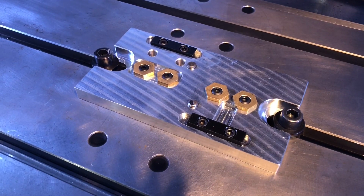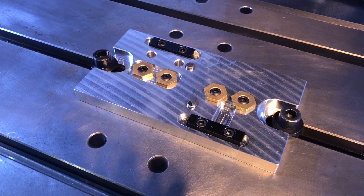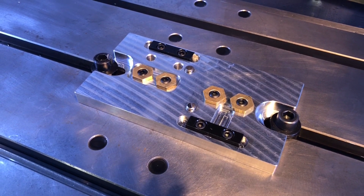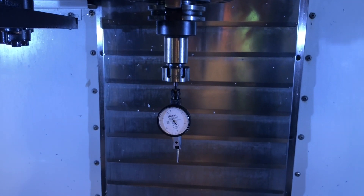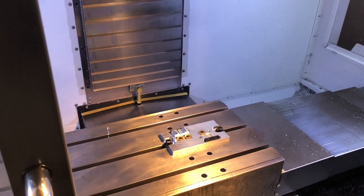The flatness of the plate was the primary datum. I used a rail for each operation as a secondary datum, and I used pins as tertiary datums. DFM was a huge factor in my fixture design, so I made it very simple so that it would be simple to make and very hard to screw up. To test my design, I first checked if the fixture would hold the stock correctly.